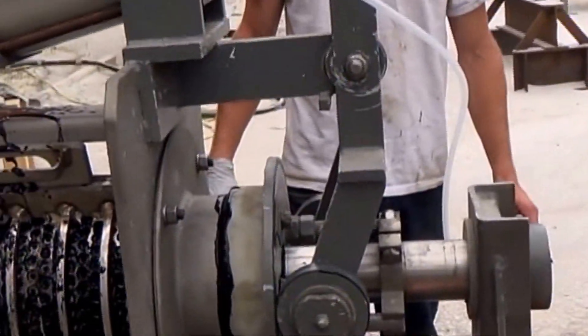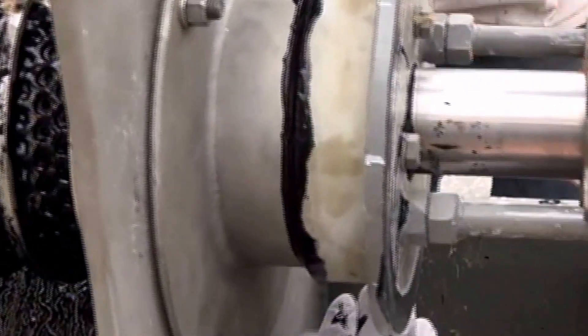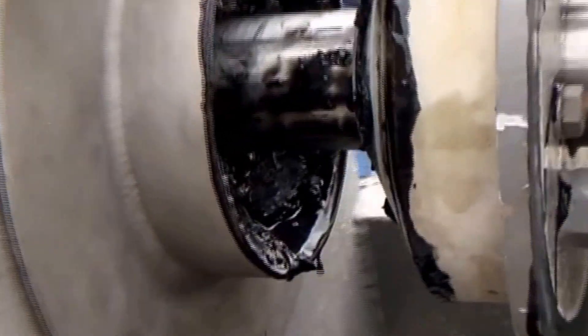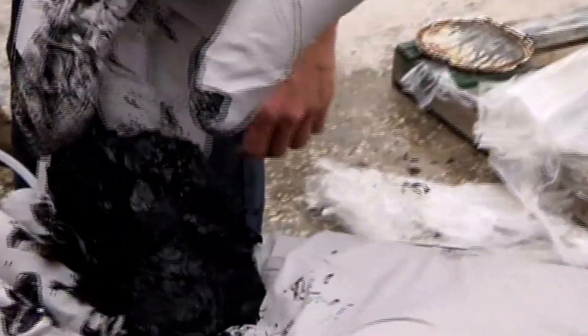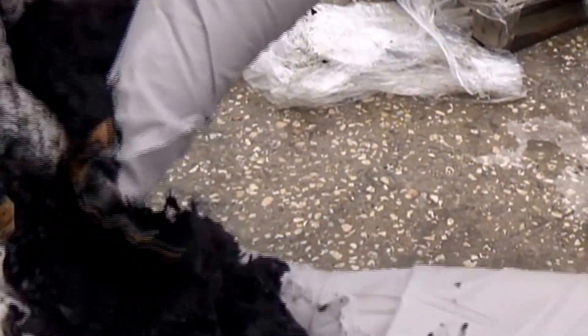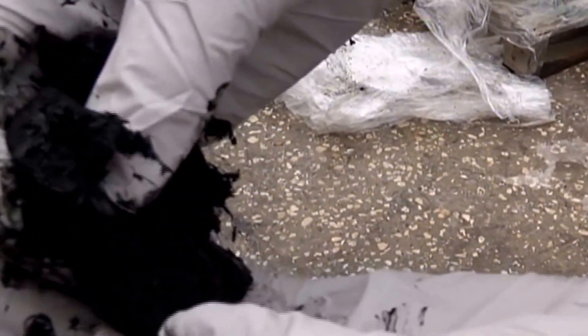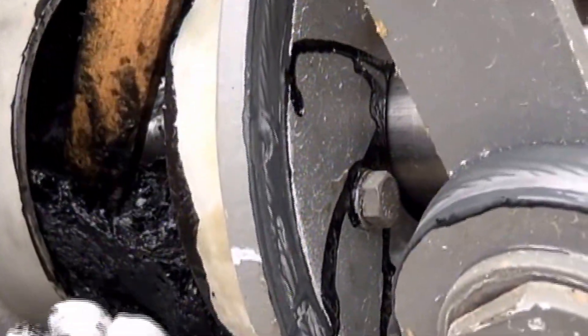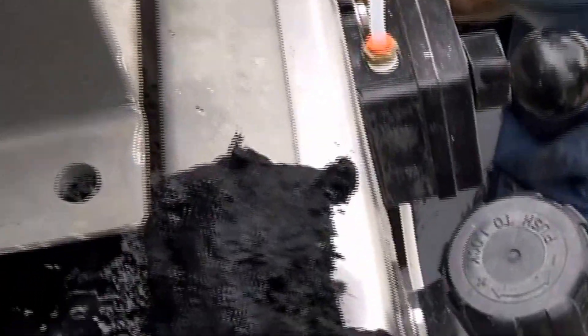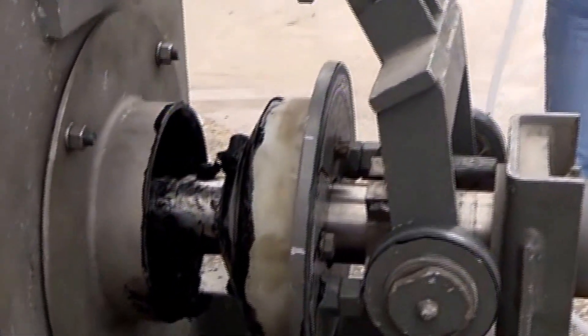I see where some of the hair was slung over the top. To stop the press, go ahead and open the cone — now you'll have to pull it open with your hands. It's not pouring out; that's why I stopped the press. Let's see what press cake we would have been making — let's dig it out. That's what we were separating with the press, and that would have come out as a mass, a lot like what you see right there. That's about as dewatered as we'd probably get it, maybe a little better. I think this would feed through the press without a problem. What we'll do is put it back in there and chase it out, and see how it chases out with some other material.